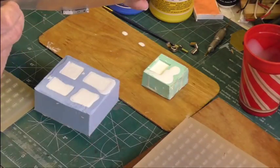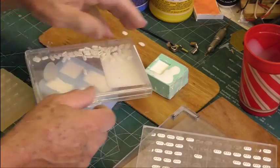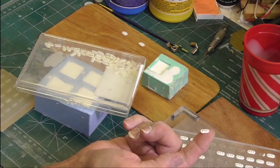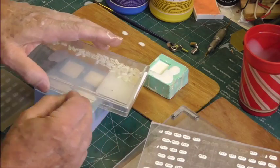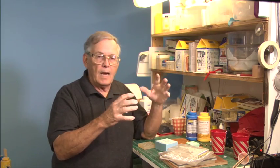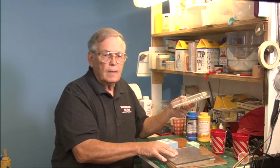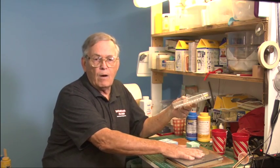This is my mold that I cast up. They are so small — let me put one on my finger to show you — they are so small that I really have to put heat to them to get them to set. They don't have enough thermal mass to cause themselves to set. So I use one of those standard shrouded shop lights, the clip-on light. I hang the bulb about four or five inches above this mold — this is my cover plate that keeps everything flat — about six or seven inches above that, and put it in a box with an open top because you don't want to build up too much heat. I heat it for an hour or so to give it enough heat to cause that urethane to set up.